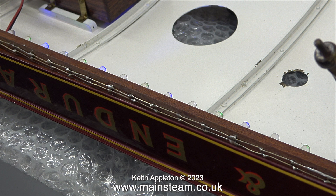This job was done long before I made videos. I think I did this job originally when I was young and stupid — it was in 2013. Or should I say younger and stupid, because I'm well on the way to 71 now, in the year 2023. All of the LED wires are soldered to each other just with a blob of solder, which is a terrible way to do it. I used to work on valve amplifiers and Hammond organs, and they used what's called the tag strip method, where components were twisted around the tags before being soldered to give mechanical strength.